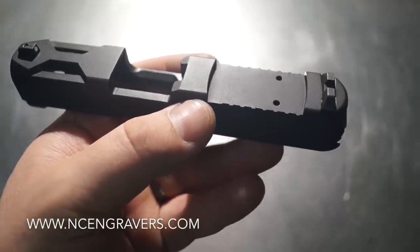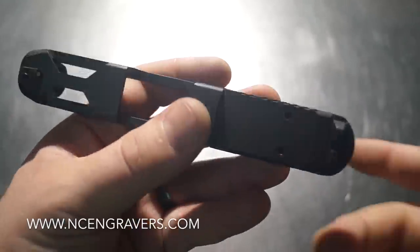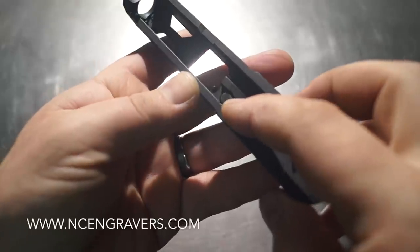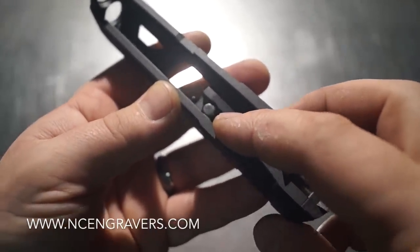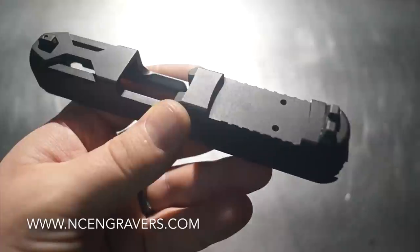And keep in mind, the holes aren't square, okay? So when you take these pegs out, or these plungers out, there's a spring underneath them, and then the plunger itself is usually a pretty flush cut, so it's square on the end. But the holes are not. The holes are usually dome-shaped.